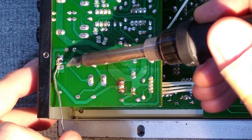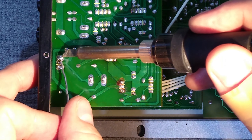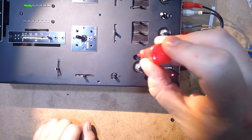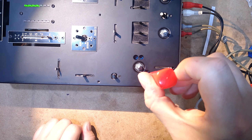Now I need to get this thing repaired and serviced before it goes back to its owner, and we'll also look at some modifications. Firstly, the mixer has a dodgy power input — a common problem with 07s, as I had to fix the exact same thing on my own 07 last week. It's easy to fix: the problem is just cracked solder joints, so flowing some fresh solder onto them fixes it right up. Next, we should adjust the output levels. The optocouplers in these mixers tend to drift over time, making the relative volumes of each channel way off. You adjust that with four tiny pots that you can turn with a screwdriver, running a test tone through and looking at the output in a DAW to get levels nice and even again.